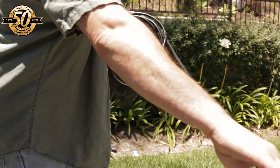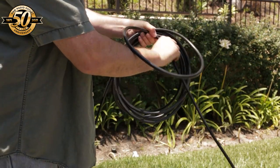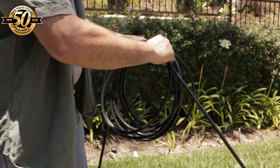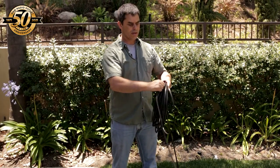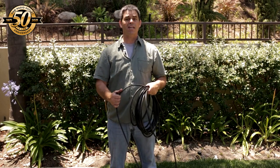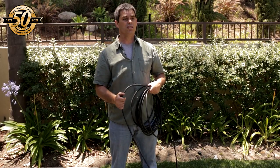As you see, it's very easy to coil this coax because I'm not putting any twist into it. The overhand loop twists it, and the underhand loop untwists it. As long as you keep going over, under, over, under, all the way to the end of your coax, you won't put any twist in the coax. You can even leave it attached to the antenna connector at the other end because you're not putting any twist in the coax.